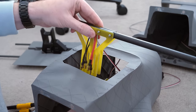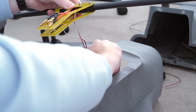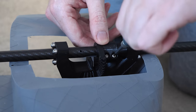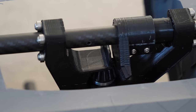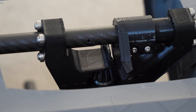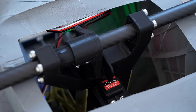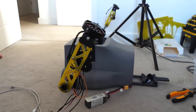Before building the wing, we need a method of tilting the motors for transition, as they are currently fixed in the vertical position. I removed the fixed wingspar mount and replaced it with a 3D-printed mount to hold the tilt mechanism. I chose a servo-operated gear system as it needs a lot of torque to tilt both motors simultaneously. These bevel gears give the servo a 3-to-1 ratio where the servo rotates 270 degrees to tilt the wingspar from horizontal to vertical. The RC car servo I used is rated for 20 kilograms at a one centimetre radius - about two newton metres of torque, tripled to about six newton metres with the gear ratio.